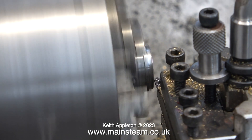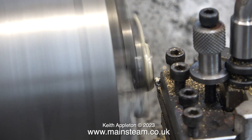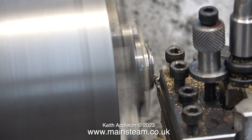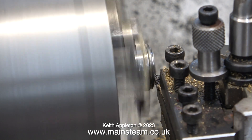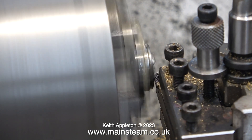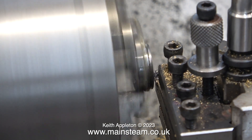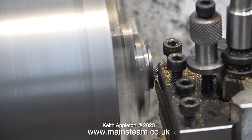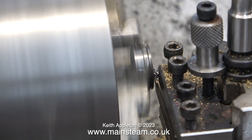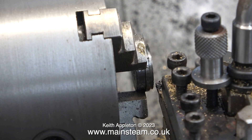To finish this part I'm using my Myford ML7R lathe with plenty of lubricant and a very sharp cutting tool. But unfortunately the facing operation still isn't good — longitudinally the finish is okay but straight across the front leaves many rings. I'm being very careful not to remove too much metal from the front bit. After machining the front I turned the part around in the chuck and very carefully machined off quite a lot at the other side.